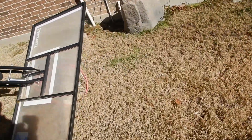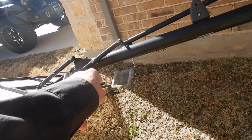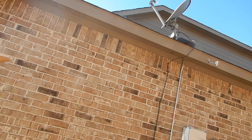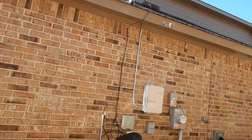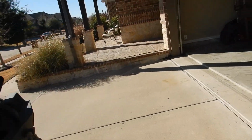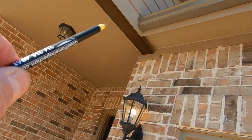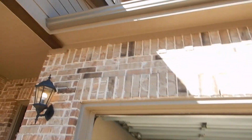Moving on along, now we're on the east side of the house. That was the south side. Rain gutter does not divert water far enough away. Again, satellite dish should not be installed directly on the roof. Siding too close. And we got some roof videos coming up or have already come and gone. Rain gutter's too close to the edge. There's supposed to be an inch gap, and there's supposed to be kick out flashing above that.